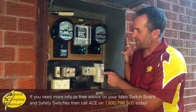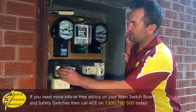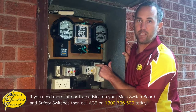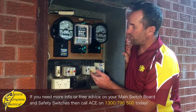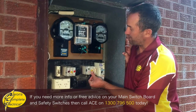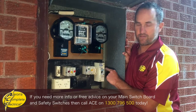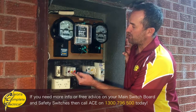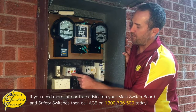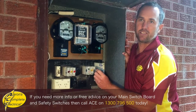So the safety switch comes back on, and then we plug the fuse back in, turn the main switch back on, and the safety switch stays on. So we know that it's not circuit number 7. Now that we're using a circuit breaker, we can leave the main switch on while we're doing this. We turn power circuit number 5 on — the safety switch still remains on. And now when we turn on circuit number 2, if the safety switch was to trip, we'd know that our fault is in circuit number 2. So we can isolate which actual circuit is causing the safety switch to trip.